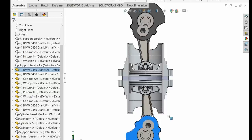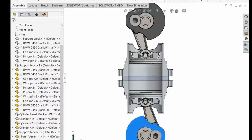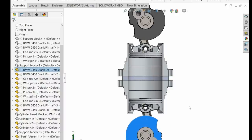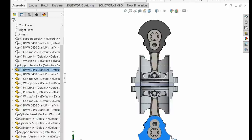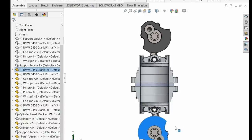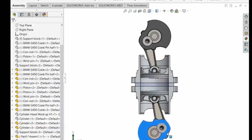But you can have a small unit like this with a tank as a range extender, and it can just sit there and stay at the optimum RPM, with no need for resonance chambers or anything like that. Direct gasoline injection, away you go, because you don't want to have that resonance chamber, you want to use that for cats. You can have a series of cats, where half the engine is basically just catalytic converters, going through stages of cleaning. So basically what comes out of your exhaust is pretty much air and carbon dioxide, and then that would be that. And then you could just have a lightweight system like this.